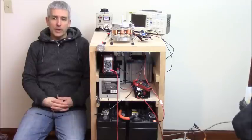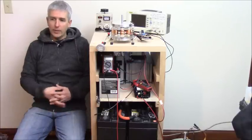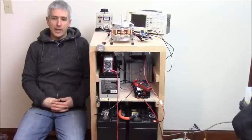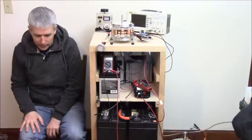That's really, when I made the big 10 coiler, the first model of it with the monopole, just like this model down here, but with 10 big coils, like we see the coils on the big motor on the ground there. The same basic system, but it had only one rotor, and now we do 2 rotors. Because if we're energizing the coil, we have the magnetic output on both sides. So you might as well push 2 rotors than one. That's why I call it the dual pole.